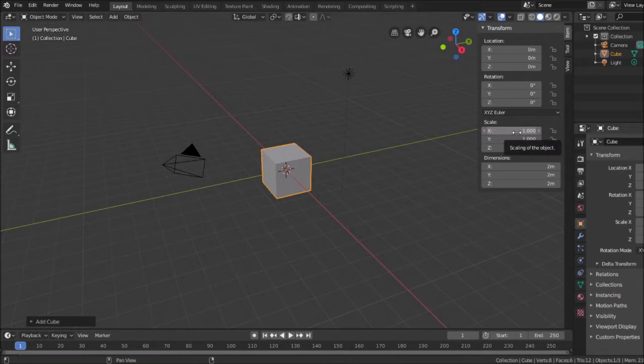Dimensions work as scale. So my scaling units are actually meters, but these convert to the 3D print software as millimeters. So even though this says 1 meter, you see this like 2m. Okay, here's the dimensions, 2 meters. That would actually scale into 3D printer, slicer programs as millimeters. So it's a nice trade-off. But where this says meters, I'm actually working with millimeters.